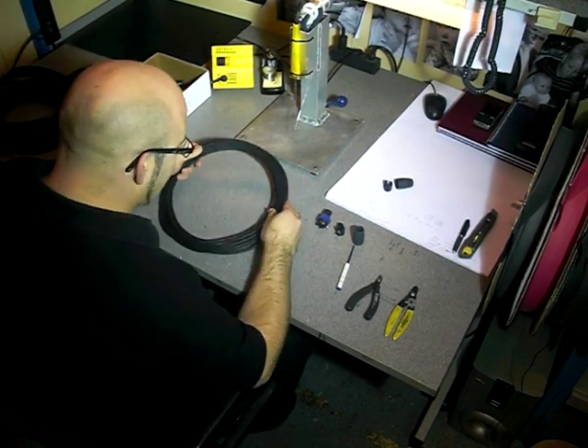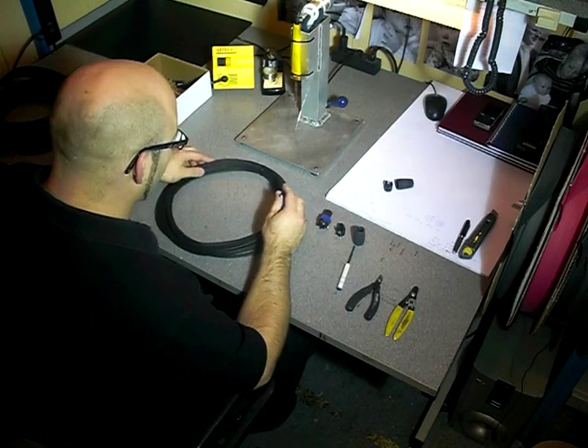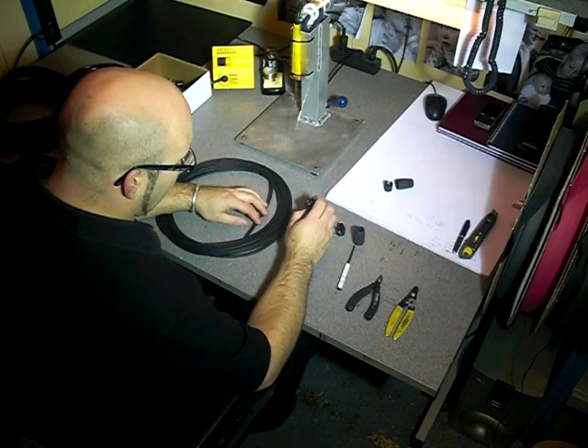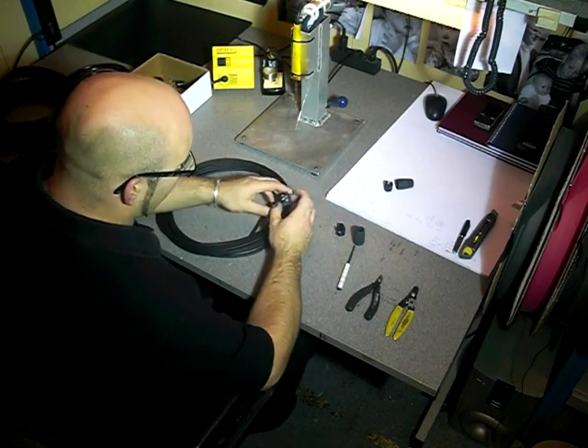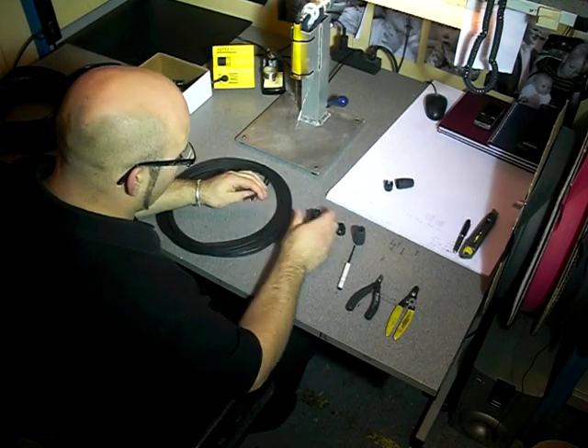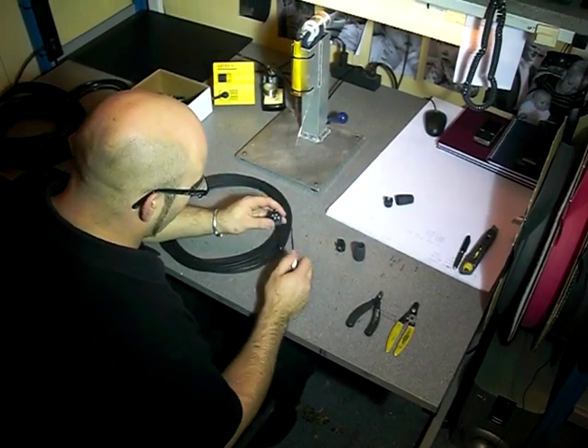Earlier on, I've wrapped out 10 meters of speaker cable — 2-core, 1.5mm. I took a 4-pole SpeakOn NL4FX. The SpeakOn is a 4-pole, the cable is 2, which means I'm going to have to get rid of 2 of the channels on the SpeakOn.